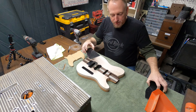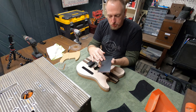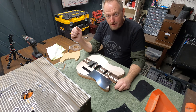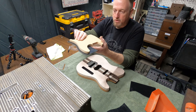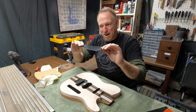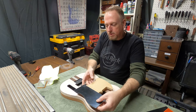I've got a couple of pieces — three actually — cut out that will allow me to make my pickguard using this template. The thing you've got to pay attention to is that there's definitely a back side and a front side. The back side is dull, the front side is shiny, and it's also got a plastic coat over it that you'll tear off when you're all done. I want the shiny side up. I'm going to have to use double-stick carpet tape. Actually — the glossy side is up, but also the glossy side is going to be beveled, so the beveled side on the router has to be down because of the way the router bit is going to cut.